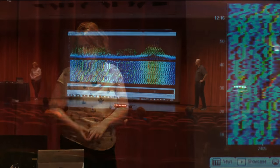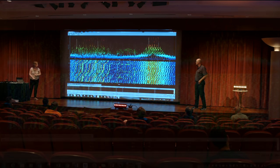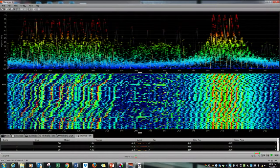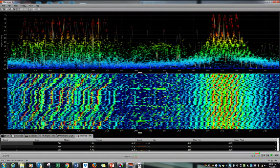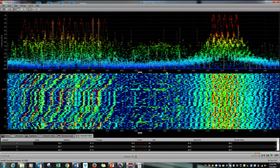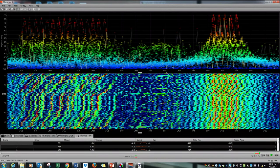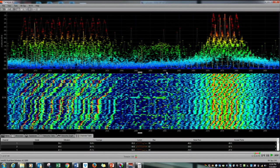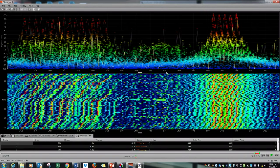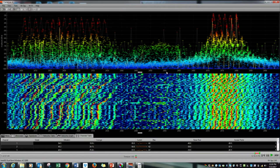So, yeah. I'm going to take a couple more questions in a second, but I do want to talk to you about what you're staring at on the screen behind me. So here we have in the room today 2 different wireless transmitters set up with my ColorSource console. One of those is set on ID3, which is going to be the low part of the spectrum. And the other one is set on ID6, which is going to be up here in the high part of the spectrum. And so we can see this is a Wi-Spy.